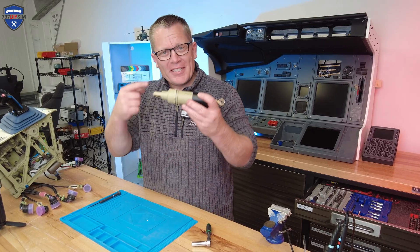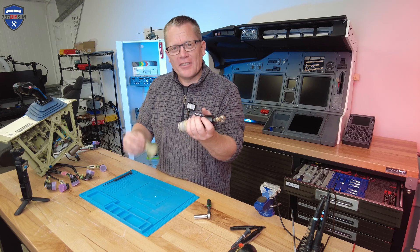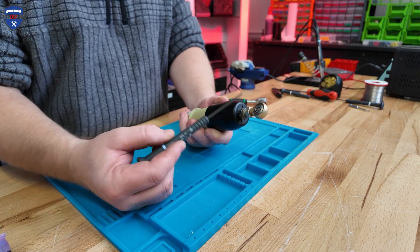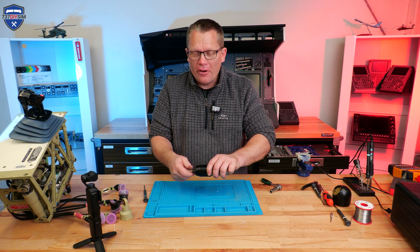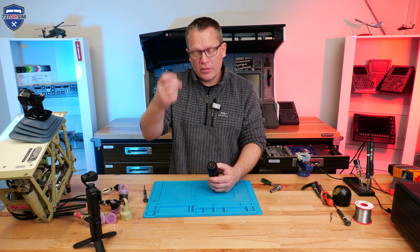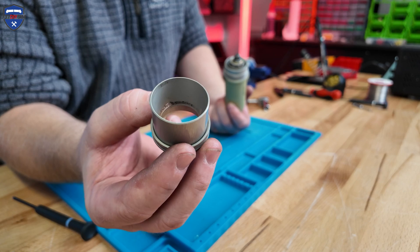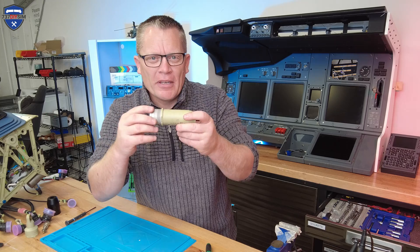In order to strip this we're going to take the cap off so we can see the insides — that just unscrews. I have removed all the locking wire and safety wire, and the cap is nothing more than a cap with a bearing on the end. Now we've got the eye end on the other end, a lock nut which is safety wired, a serrated washer, and then a lock tab which fits into the locking groove of the rod. That is very important when working on real aircraft to make sure they align correctly.